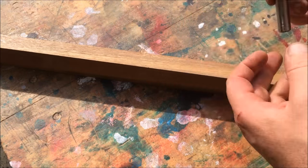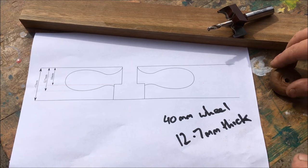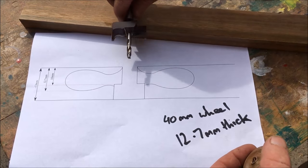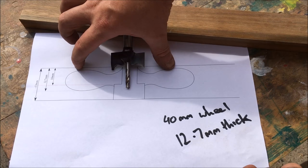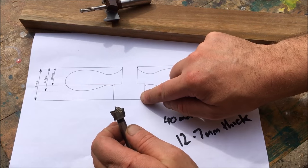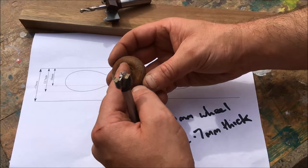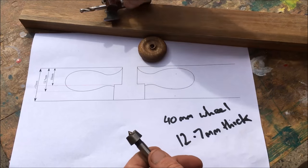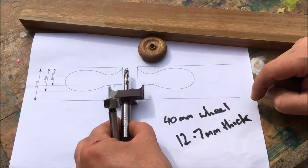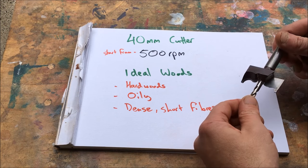Here's a schematic of how I do the wheels, which gives me much more consistent quality. This wheel cutter is 40 millimeters in diameter and cuts half an inch thick. On one side I come to the wood and cut it just flush to the edge. Then I take a Forstner bit and drill out a little bay — about 10 millimeters from the top of the wood. That makes a little hub on the inside, so when I go to cut the other side it doesn't matter if the wood is thicker than the final wheel. I've got that gap to allow movement and to clear chips for a cleaner cut.